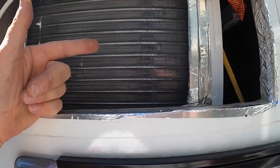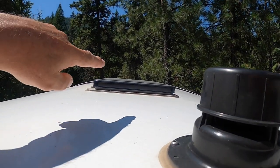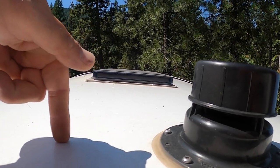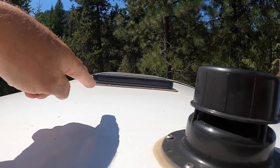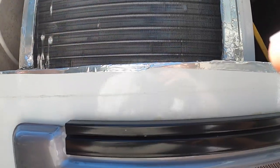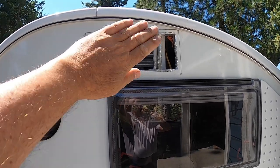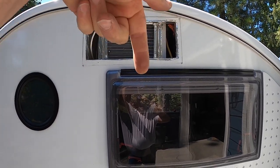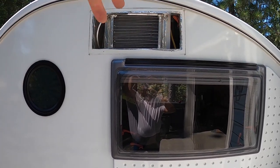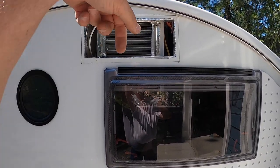So where's this air conditioner going to get its cold air? Well, that's what this guy gave me an idea. See my fantastic vent over there? What if I put another fantastic vent right here, in the roof, just like that one? That would allow cold air to come in the top, go into the top vents, go around and go in the side vents, and vent that entire area. That entire area would be vented, and all the hot air would come this way with no chance of the hot air that's coming out getting back into the intake.